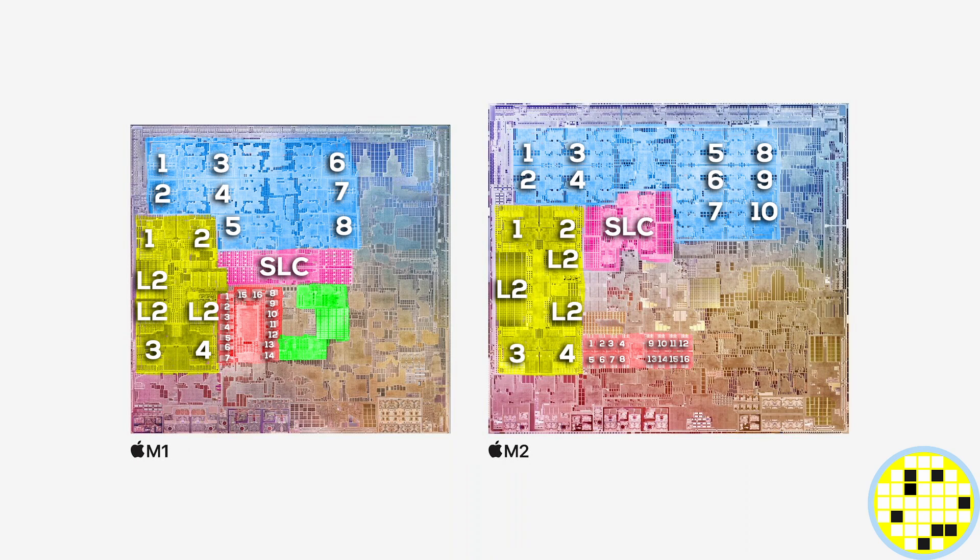The CPU efficiency cores are still a lot smaller than the performance cores. On the M1, the four E-cores are somewhat asymmetrically clustered around the L2 cache, with some cores being a lot closer to the cache than others. On the M2, the whole cluster has been changed — now all cores sit a lot closer to the shared L2 cache. The M2 E-cores are most likely based on the Blizzard design of the A15, which would mean that the E-cores get a bigger performance uplift over M1 than the P-cores. Coming back to the 18% multi-thread performance uplift, the new E-cores should be responsible for a bulk of that number.